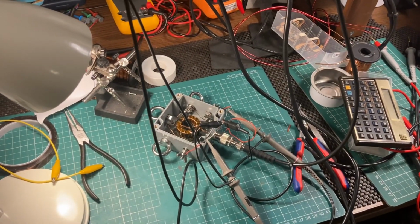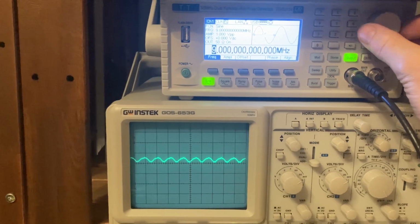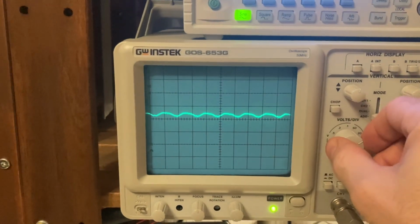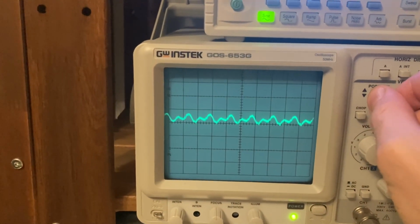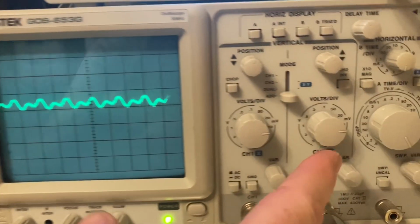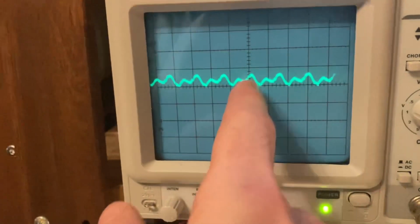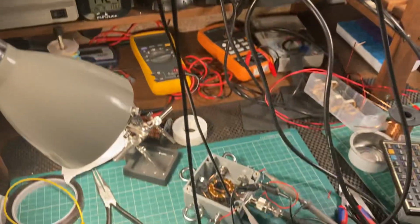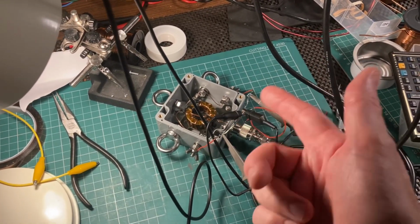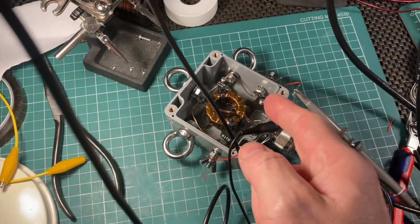That's pretty good, right? And I think that holds true even if we go down, say, 40 meters. In fact, it's a bit messy down here. It's kind of interesting, but again, it's 6 ticks at, what are we on, 10 millivolts, so 6 millivolts of error in there somewhere. So it's getting better with the lower frequencies. The balance is better. But again, for a 1 volt peak to peak, the difference in the currents is millivolts, which is nothing. So actually, I think the balun's probably okay.